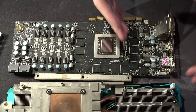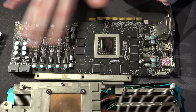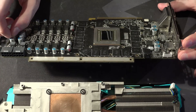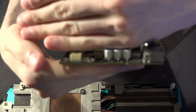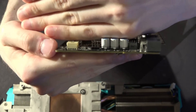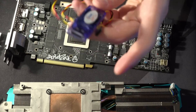It actually gives temperature monitoring for basically all of the main voltage regulators on the card. So we've talked about the chokes, the fact that this VRM runs really cool. The three pins over here — I've added this connector right here, and the reason I added that is because recently I picked up one of these: an Infineon USB-005.